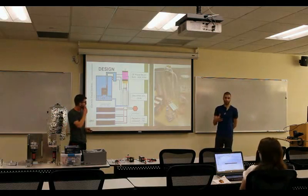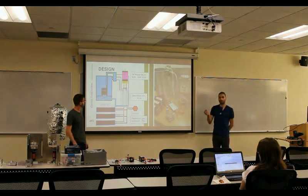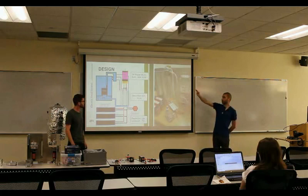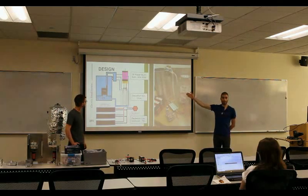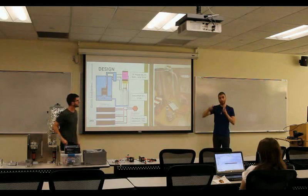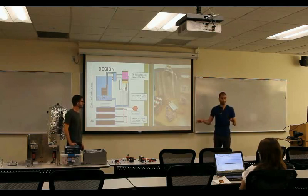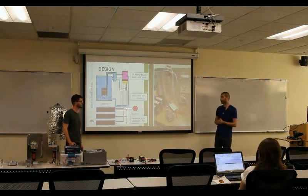On the power components: we selected a T-Motor brushless DC motor — a three-phase motor that turns two poles on, two poles off in a rotation of six. It's similar to an AC induction motor but technically called brushless DC. It outputs five kilowatts total and spins up to a maximum of 60,000 RPM. This motor is quite oversized for both pumps, but it gives us the power headroom to play with and scale back if needed. It was better to start with more power than not enough.